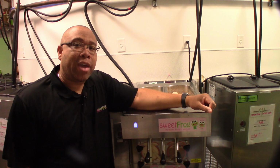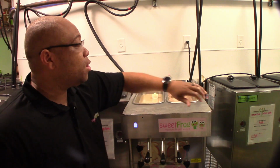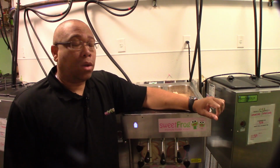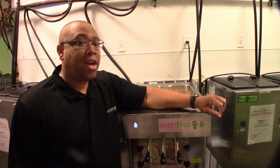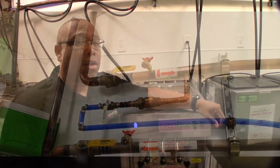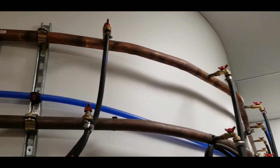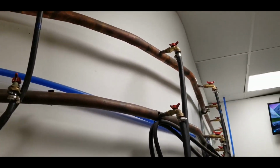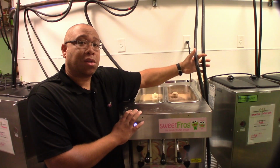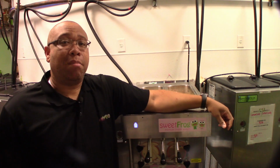In almost all of our locations, our machines can be turned around for an easy cleaning process. Most of our machines are glycol-based, water-based, or air-cooled. Here in my Horseheads location, all of my machines are glycol-based. What's glycol-based? Glycol is just basically a big radiator for our machines. They have 2 hoses going into the machines. You have one inlet hose, and then you have an outlet hose. These hoses go up to the big cooler unit up on the roof of the building.